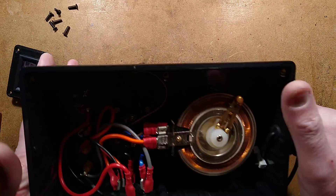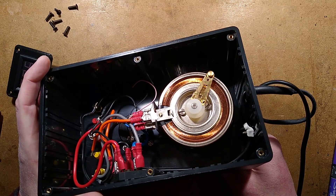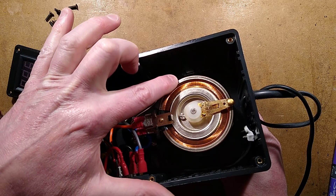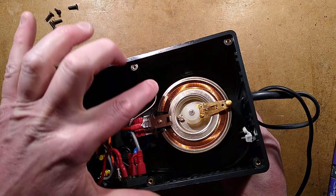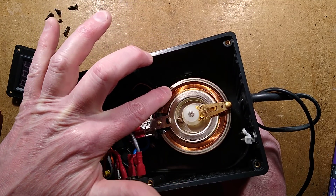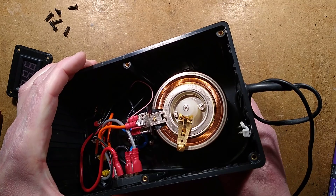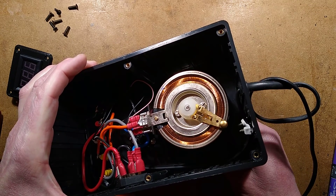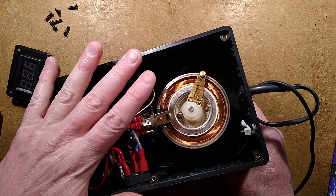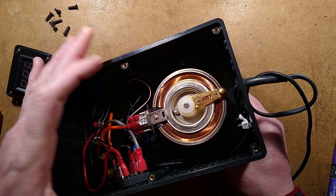So here is the Variac — let me show you what's inside. When you rotate the knob, it has a wiper arm that makes contact with the common connection. This is like a toroidal transformer where the windings have been brought up in a little ramp, pressed flat, and the surface has been buffed off. As you wipe this arm around it basically goes from one end of the transformer to the other, giving you a perfect AC output at a fairly low current — in this case about 750 milliamps — whether it's right around at 240 or in the middle position at say 120 volts.